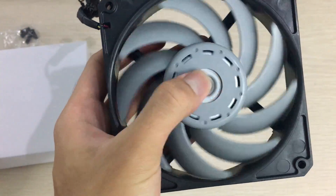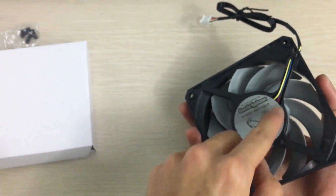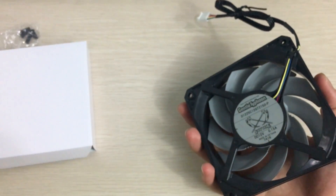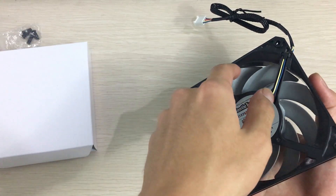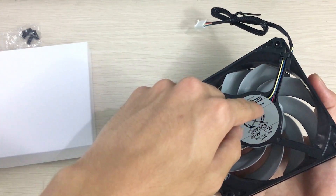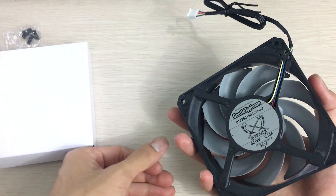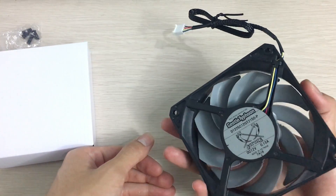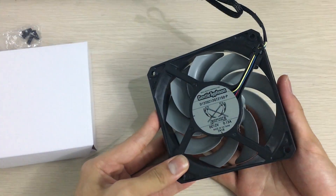The hub is fairly large, but I don't think it's a big deal. The middle part of a fan rotates at a slower travel distance than the outer part — not in RPM, but in linear travel speed — so even if blades extended to the center, that area wouldn't push much air anyway. Having a large fan hub is not really a problem, and while smaller is generally better, it doesn't make a dramatic difference.